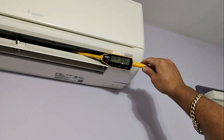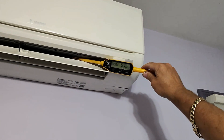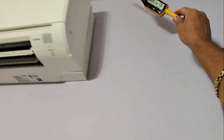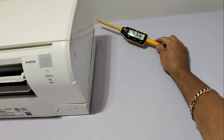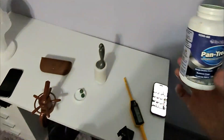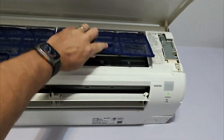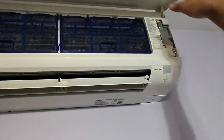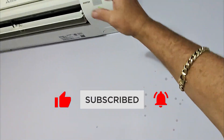All right, let's just check our discharge temperature. We're at around 51.5 degrees and our ambient room temperature looks to be around 68 to 69 degrees, so we've got a beautiful delta T there. Pro tip: we're going to use some condensate pan treatment tablets — I'm using the ones by Nu-Calgon. These little green tablets — we're going to drop one on each side right behind the filter into the drain pan. Those are typically good for three to four months, and they're going to help neutralize the condensate and keep that drain line clear.